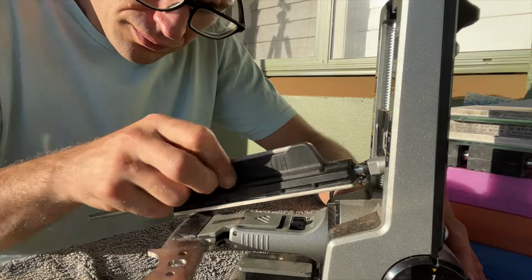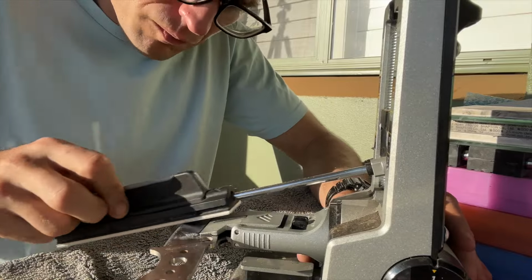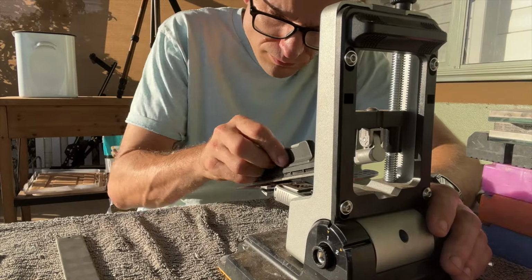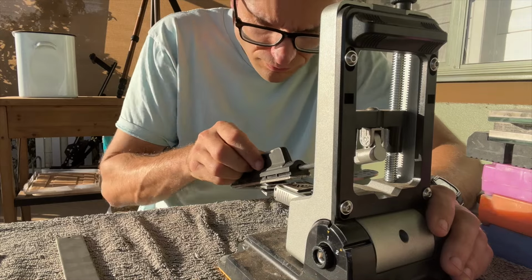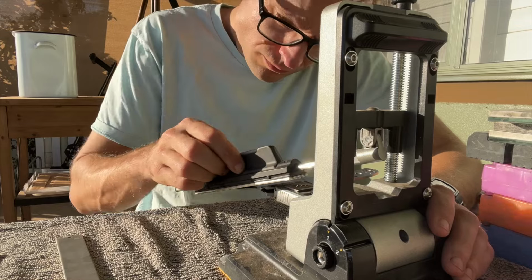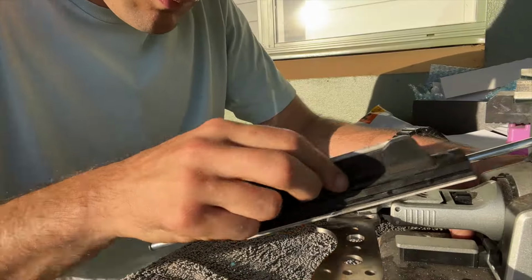The 600 stone in this one here, my 600's quite well worn now, so this is what starts to be like a proper sharpening, almost finishing stone. You could finish that there, you could then buff that or strop that, and you'd probably be fine. Then you move up to the 800 grit stone, which is again a little bit finer, much narrower grit progressions on this machine here, and again pretty factory looking, pretty industrial looking under the edge.